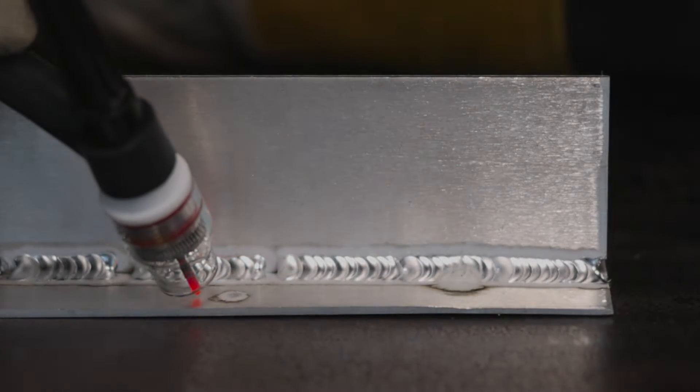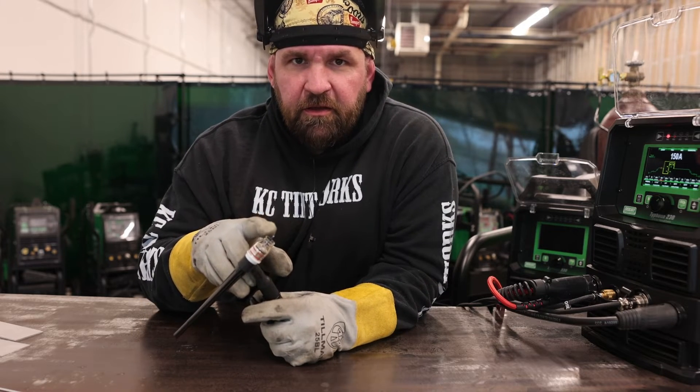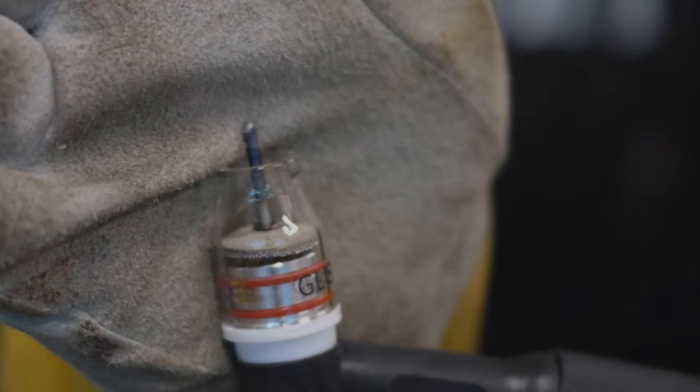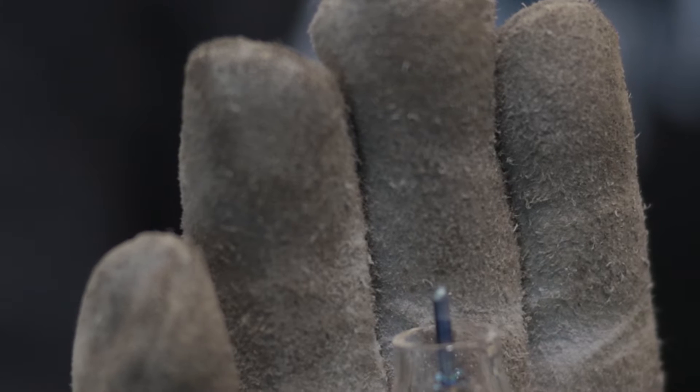It lit. Those starts were not very good — we did get it to strike an arc. On the close-up, you can see the tungsten was heavily oxidized. That's because we're running 150 amps and this machine came in at one second of post flow. As soon as you terminate that arc, the tungsten is still hot and gets exposed to atmosphere because it hasn't cooled down — it's going to oxidize. That makes a layer of oxidization over the surface of the tungsten, which makes restarts harder. So post flow can actually affect your starts.